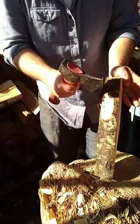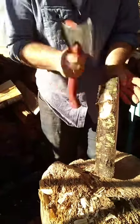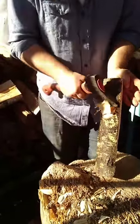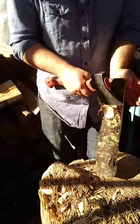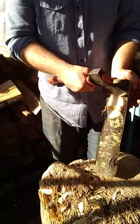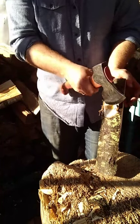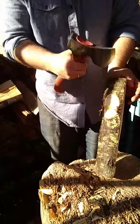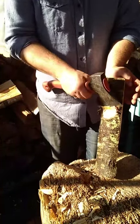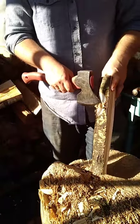You can see I'm actually cocking the axe quite a bit so as I waggle my hand it's biting into the wood right where I want it. Until you have that familiarity with your axe, make sure you start low and walk up to where you want to be — don't try and hit exactly where you want to be right away. Chances are you're going to hit higher than that, and if you're already within two inches of your hand, that's too high and it's not safe.